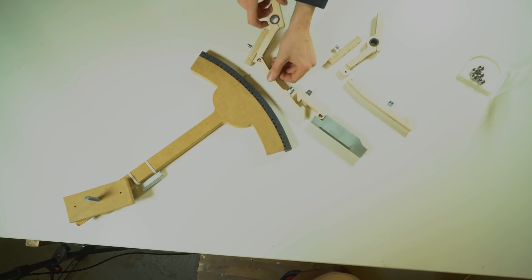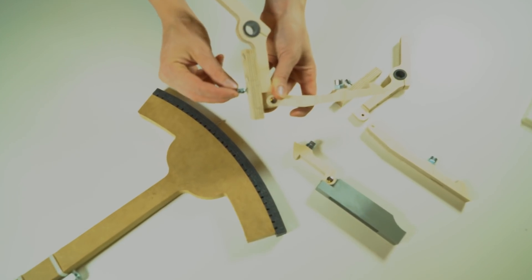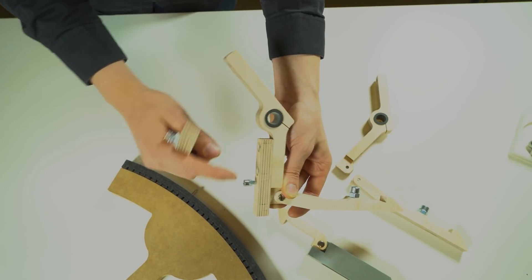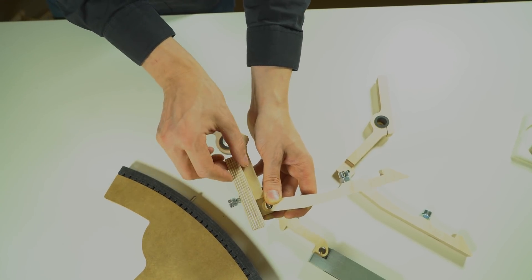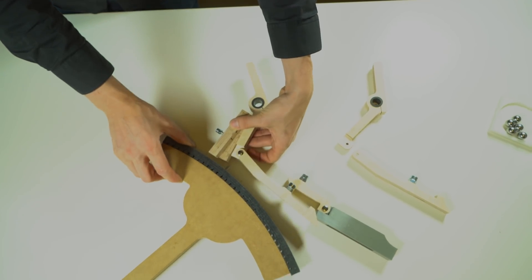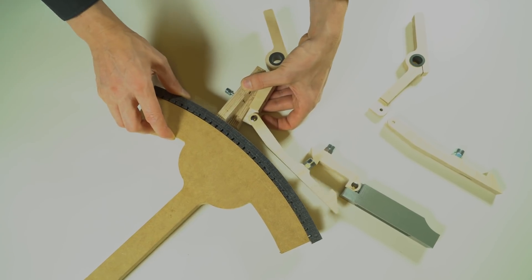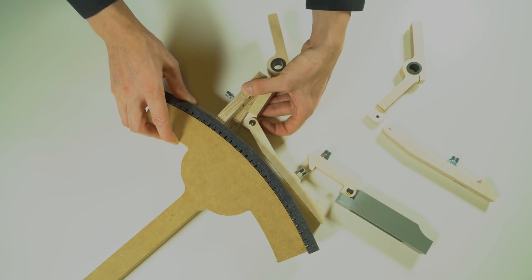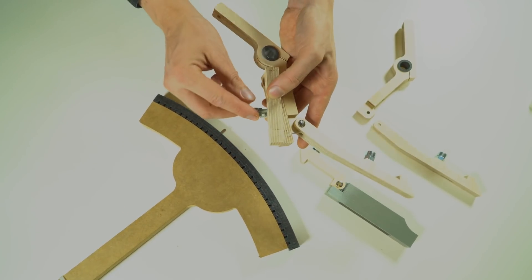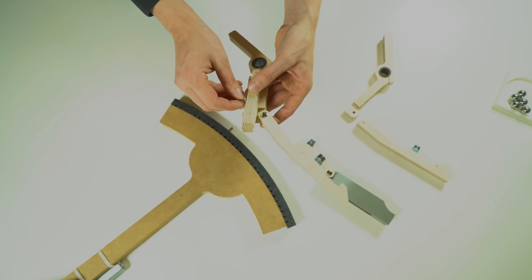If we look more closely, this screw is a timing adjustment screw. If we loosen these screws and tighten this screw, this piece will shift in angle. Which will result in the programming pin hitting the registrator later, which will result in the instrument playing the note later. So this little screw is responsible for making the whole machine play tight.